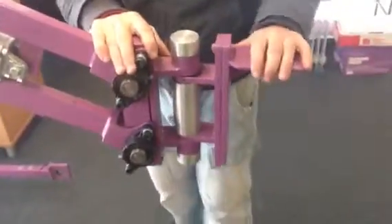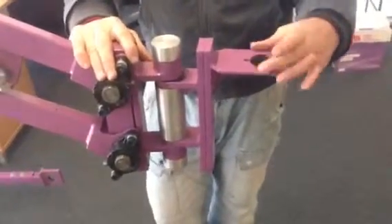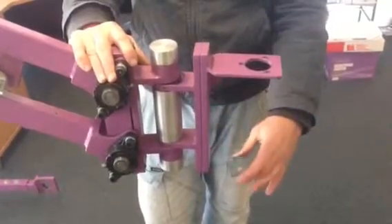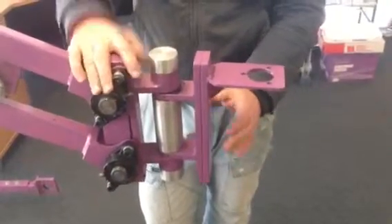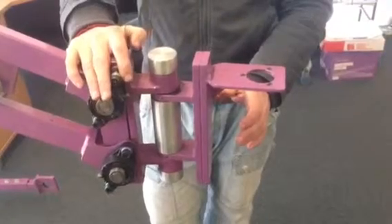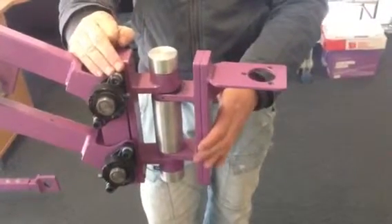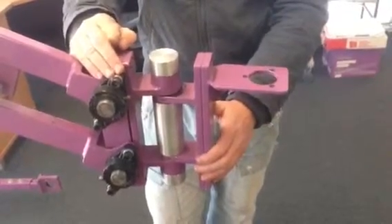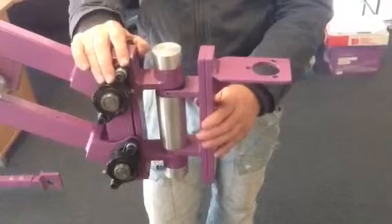With that lightweight aluminium, we would look to have a boom point at the start — a complete swivel — a boom point here, and a boom point here. On the end tooling we would be looking to have two grippers, and those two grippers would allow us to grip the part. We would also have a manual rotation where we pull a lever, rotate it to enable access where we need, and then lock it back in to vertical orientation.